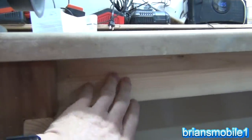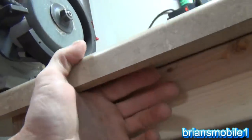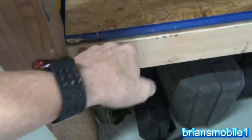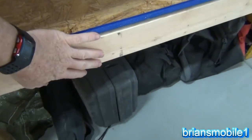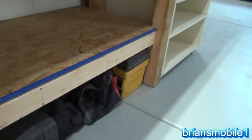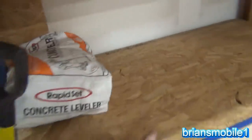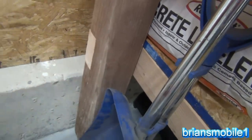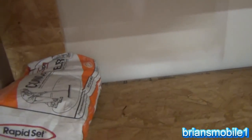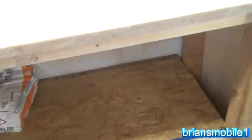Now why did I have this one so far back? Everybody puts them right up here. When you look at the lip of the free countertop that I got, I wanted a little bit of room to be able to clamp with. So I set this one recessed, and I also set this one a little recessed — I don't want to bang my shin on it. I want it further back. I set the height to a little over a foot because most toolboxes are a foot, so I can fit things underneath. I ran the plywood, and the board on the backside is pretty far back to give support so I could do a little cantilever off the back. I'll figure that out later, but it gives a lot of good storage space down there.